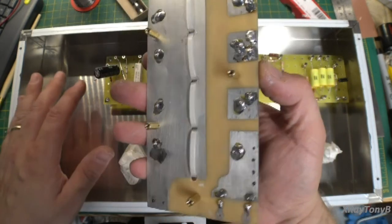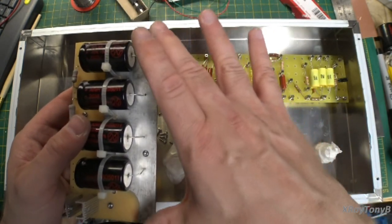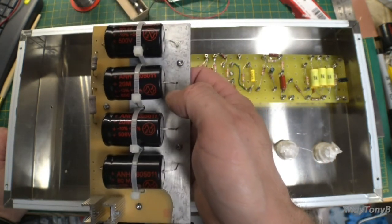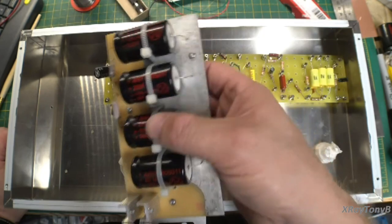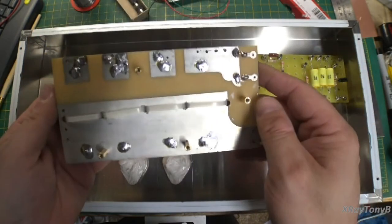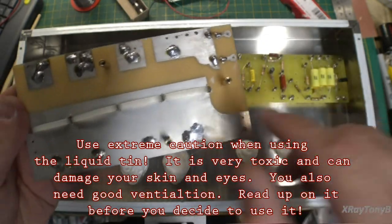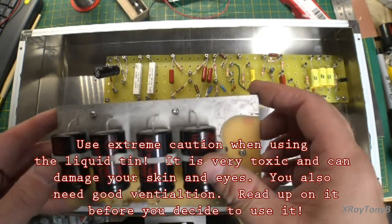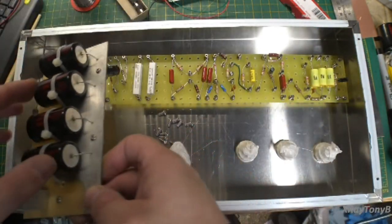Those two things are all that need to be added yet. Making a board is this simple — I try to etch as little as possible to save the etchant. All this part here is ground, which is fine — just shielding on both sides. I dipped it in some liquid tin to prevent the board from tarnishing. If you leave the copper open without conformal coating or liquid tin, the copper will start to tarnish and corrode over time pretty quickly. So that protects it.